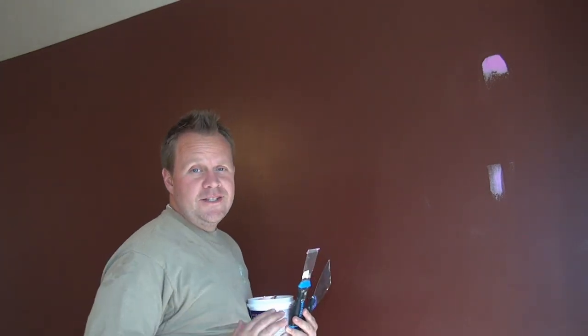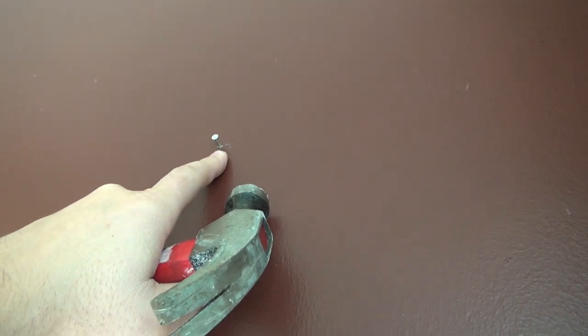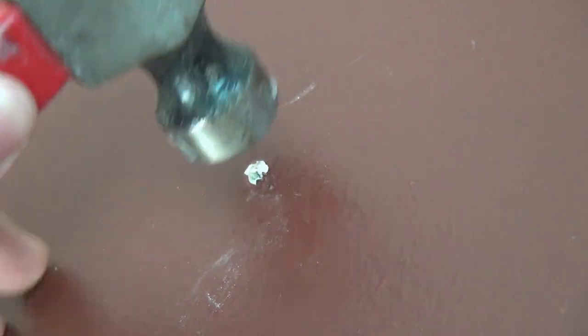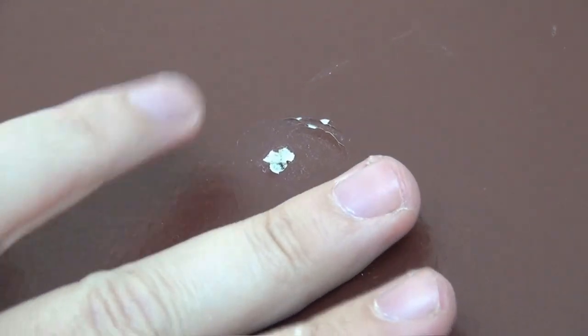One of the common areas you're dealing with is nail holes. When you pull the nail out, it makes a little chipped area that's actually a little bit higher than the wall. Before you spackle over the hole, it's a good idea to take your hammer and give it a little smack to hammer it in just a little bit. That allows you to take the spackle, spackle over it, and get a smooth surface to paint over.